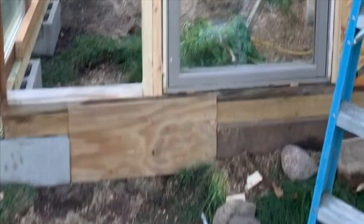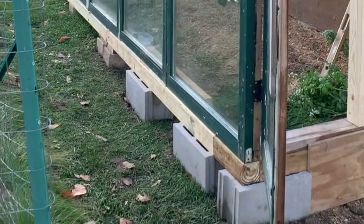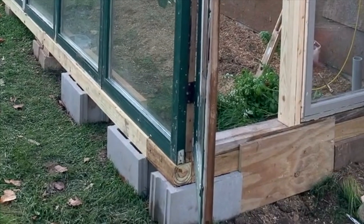It doesn't really show great shots, but it did catch this one clip. Let me pause it — it shows here the foundation. I basically put cinder blocks down and leveled them off with a level running up the slope. I started at the lowest spot in the foreground, and you can see they're kind of dug in, then going to even smaller patio stones up at the very top. Once that was nice and level, I took some 4x4s I had left over and started setting those sliding glass doors on that and screwing them together.